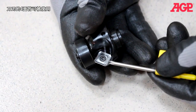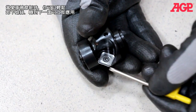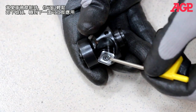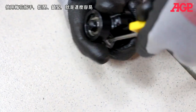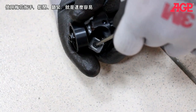The carbide inserts are indexable — they have four faces that can be used. If one side is worn, you can simply loosen the screw and turn to the next unworn face. We provide the Torx driver. Simply loosen, turn, and then re-tighten.